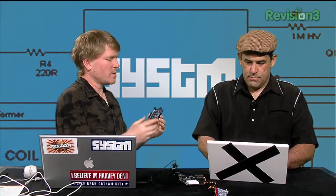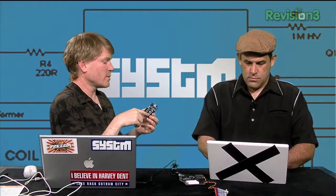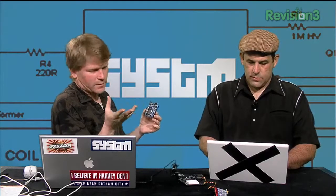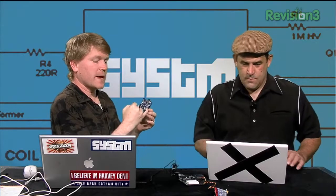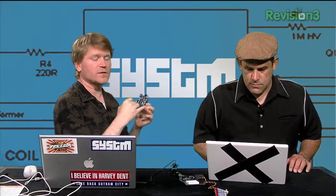It's not that we're leaving out any crucial components or anything like that. Anytime a software installation happens, you might have wonky little issues. If you want to use an Arduino board, you're going to have to do a little bit of configuration to get a servo onto an Arduino board, because the ground and the power, which is what powers a servo, are very different on the board from where the actual data port is. So you're going to have to either split up those wires or get an Arduino shield.